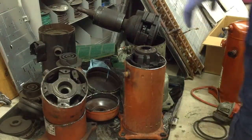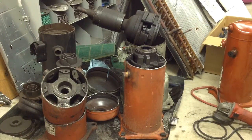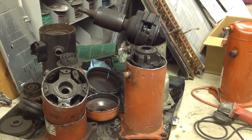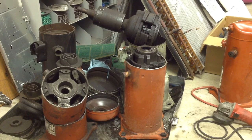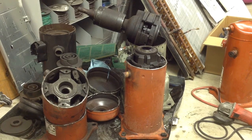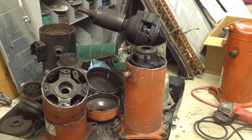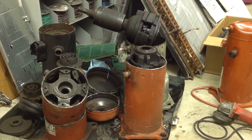This compressor is about two years old — manufactured in 2013 but installed in 2014. I found it a couple days ago pulling lock rotor amps. It's three-phase, so I tried reversing the leads — Eric M mentioned that — but it didn't work. So I replaced it with a Copeland.